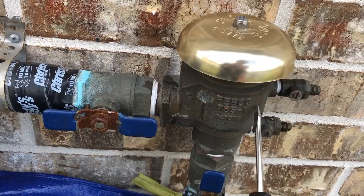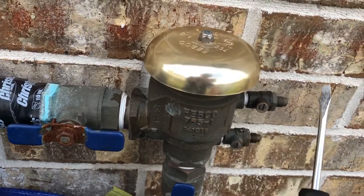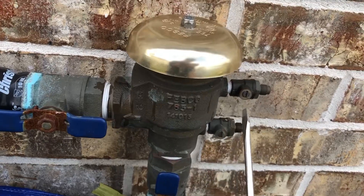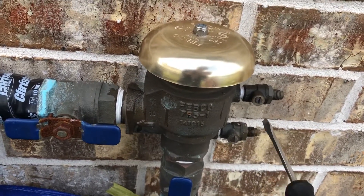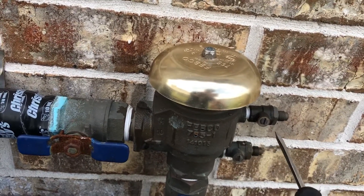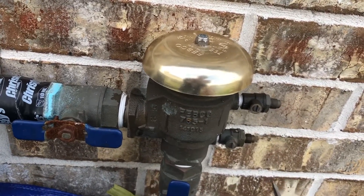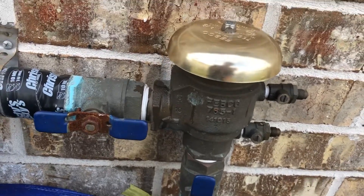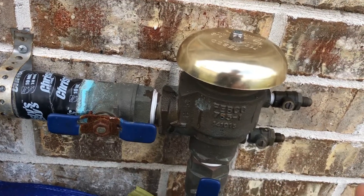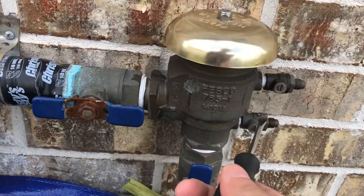When the temperature falls below freezing, the water in here will freeze into ice — and ice expands, putting so much pressure it can actually crack this device. Even though it's made of steel, there are plastic components inside, and ice can crack or break even steel or concrete. So we bleed it to get the water out and leave no water in the system.